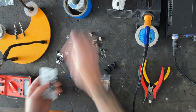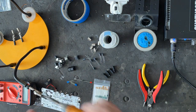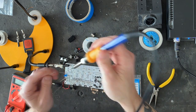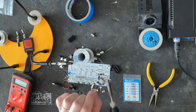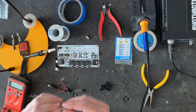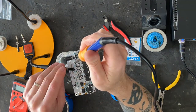I did a time-lapse video and I'll go ahead and put that on the screen for you. The kit is really well laid out — their instructions were really great, it was all nicely packaged. They have you start with the PCB, populate the jacks first, then put in the ICs and capacitors, then all the resistors. In this kit, all the resistors stand upright as opposed to being parallel to the board like they were in the previous kit.